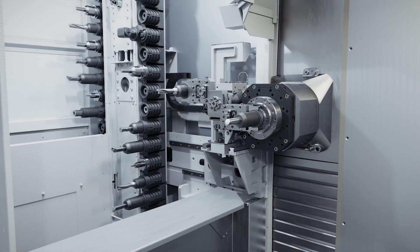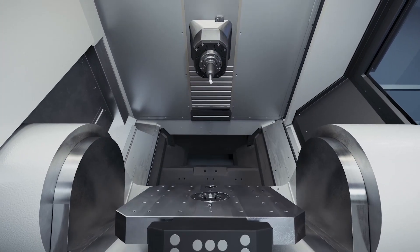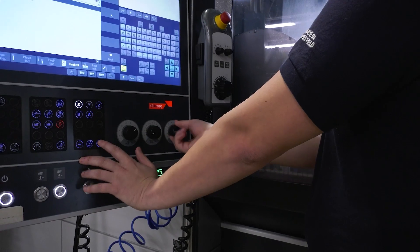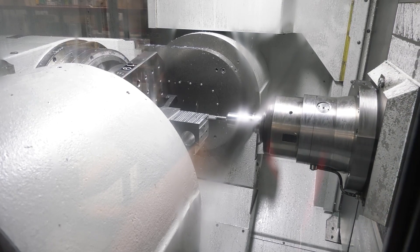To go to the utopia of automation, you're talking about taking a cutting tool and grinding it, putting that tool into a tool holder, and putting that tool holder into a feeder system — maybe a robot-fed feeder system — into a gantry-loaded system that takes tools to a machine. The machine knows the life of the tool and the life required for the production set of parts being fed to it, so you're taking tools into the machine and re-grinding them as needed.